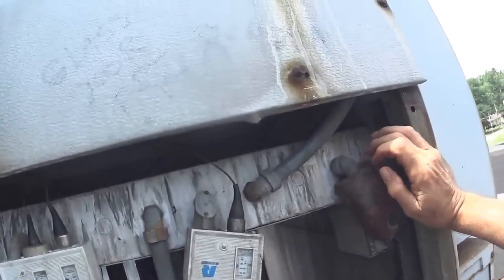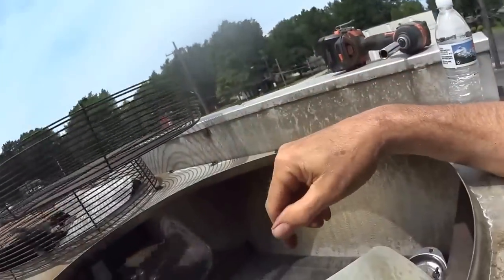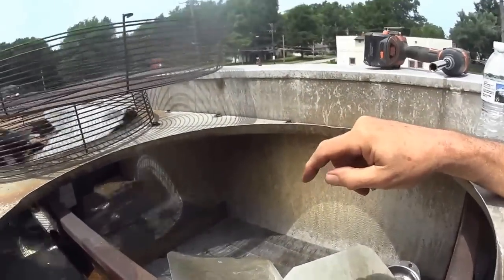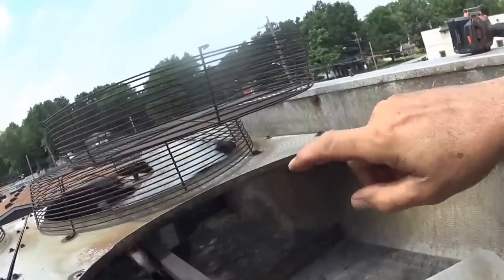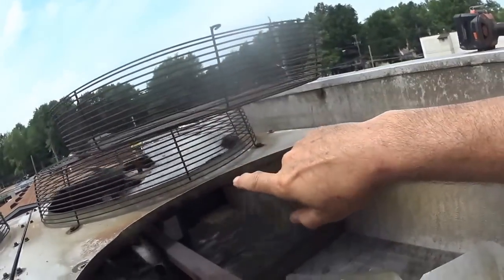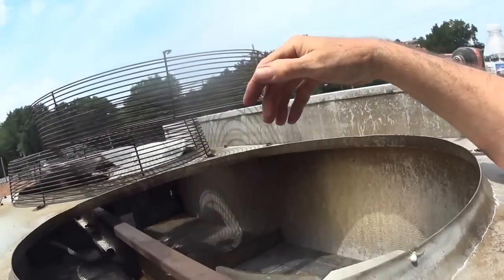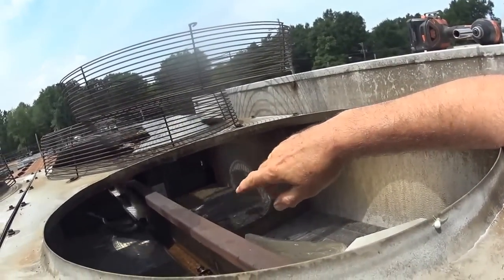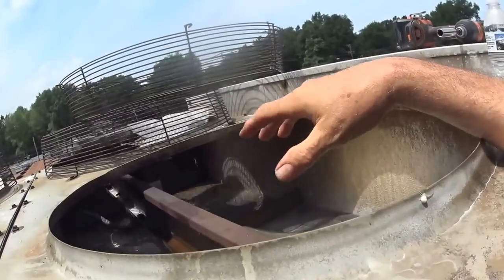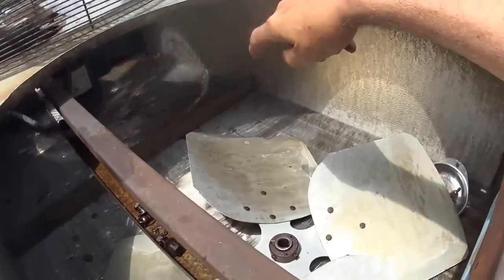And what happened was, this condenser motor went bad. That was the only one running. With this one not running, they should both be running, both of them pulling the air up. If only one's working, that one's blowing the air up and it's sucking the air in here, past the inoperable fan, instead of bringing the air up from below through the condenser coil.